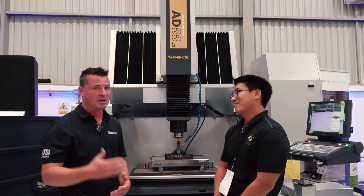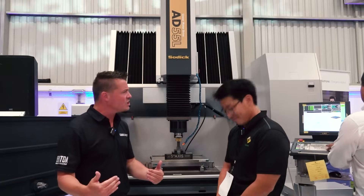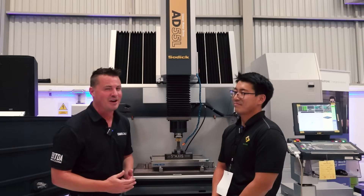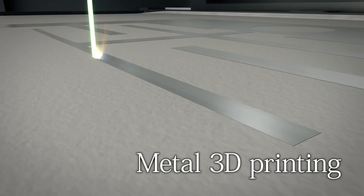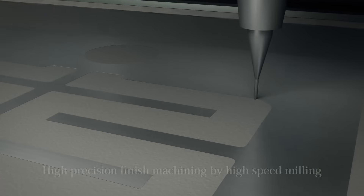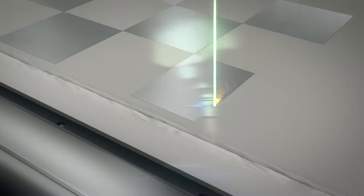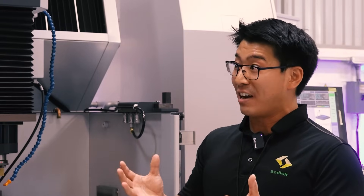One of my favorite topics — additive manufacturing and 3D printing. This is a world that people were talking about, but it didn't move quite as quickly as everyone wanted. But we've seen it thriving and growing. There are concepts for internal components with splines that we just cannot mill. There are so many major types — DED, FDM, binder jet. We have a powder bed system. Why is that so good? We need density. Most of our customer base, honestly, is in the mold and die industry — we want a functional final part. A powder bed can do that. What's really unique with our system is our one-process milling machine where you can finish 90–95% of the part, because not only do you have the laser additive product, you also have a 40,000 RPM mill that goes along in one machine. So you're 90–95% of the way done with your part or mold.